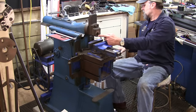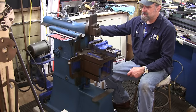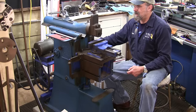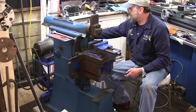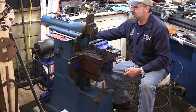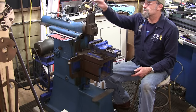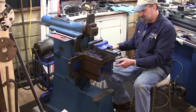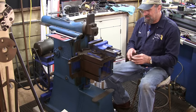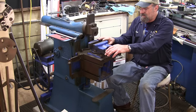We're not going to be going that fast — we'll have it in low speed, cutting at about this stroke. We're belt drive on this machine. We'll move it by hand for setup, adjust the stroke length, and everything else. We'll be feeding down with the compound to create our depth, and controlling side to side to control the width of the key. We've got these two things out, so we'll take that part of the project into the lathe, and we'll pull our vice off because we're not going to hold the part in the vice.